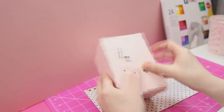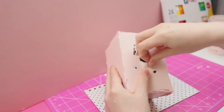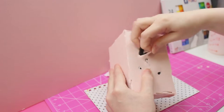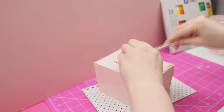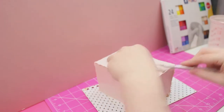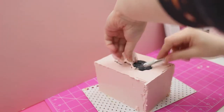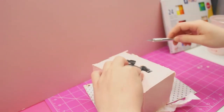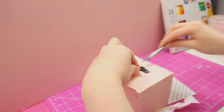As you can see, the silicone has leaked under my model, which is a bit of a pain in the butt, but it's okay though, because I can just cut the silicone with a craft knife. I think in future I'll just use sticky tape instead of the glue gun, because the glue gun seems to sort of push it up a little bit so the silicone goes up underneath. But it's no problem. All I need to do is just get the silicone flaps and just cut them off. That's all we need. Problem resolved.